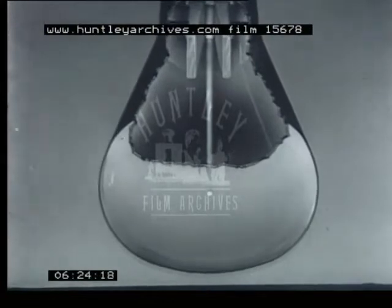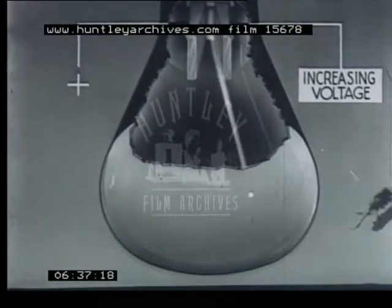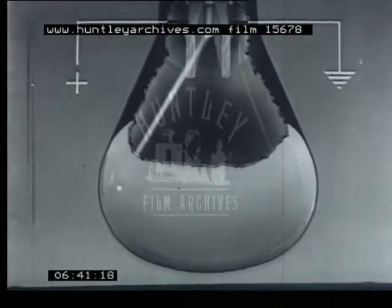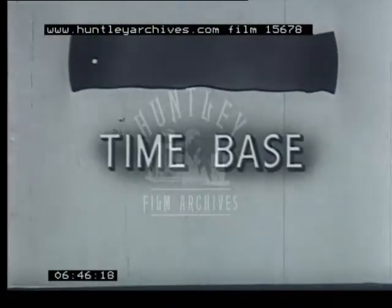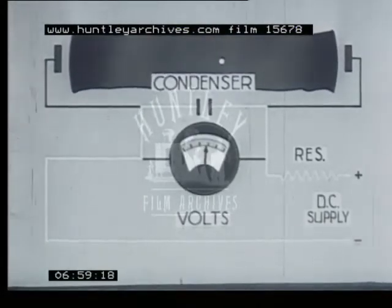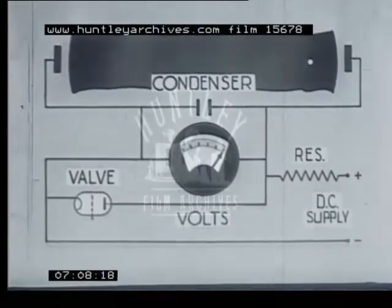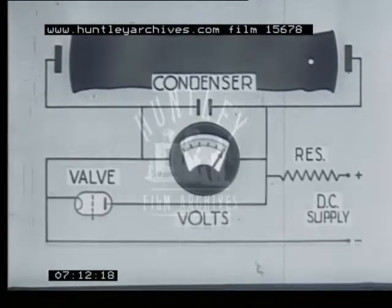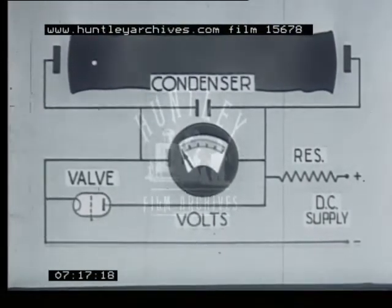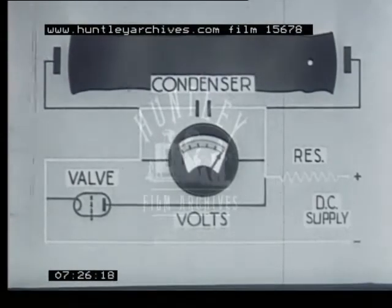To produce this horizontal movement of the spot in practice, the X-shift is adjusted to bring the spot to the left-hand side. A steadily increasing voltage is applied between the X-plates and the beam is bent to the right. The voltage is then quickly reduced to zero and the spot flies back. A condenser connected across the deflector plates is charged from a constant DC supply through a resistance. The meter shows the voltage building up across the condenser. It is arranged that the valve connected across the condenser will conduct when a certain voltage has built up across it. The condenser then discharges rapidly through the valve and its voltage drops to zero. The valve then ceases to conduct and the condenser charges up again.